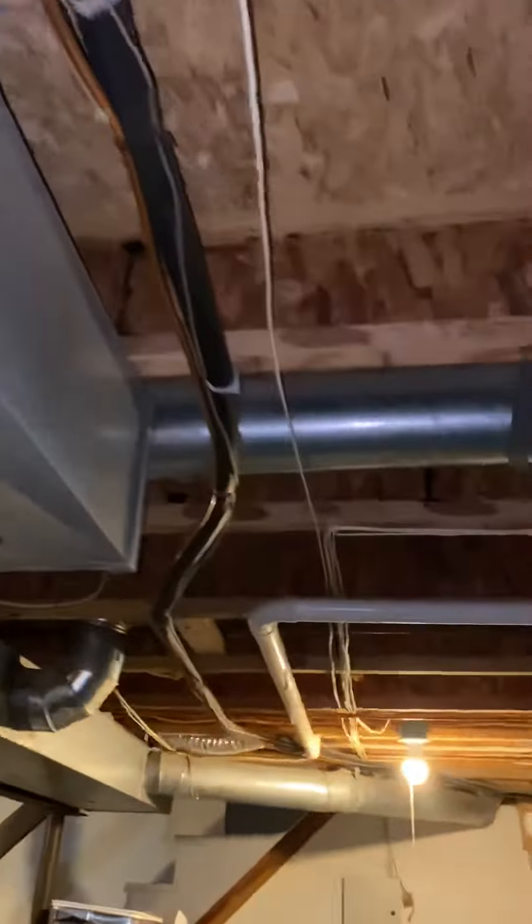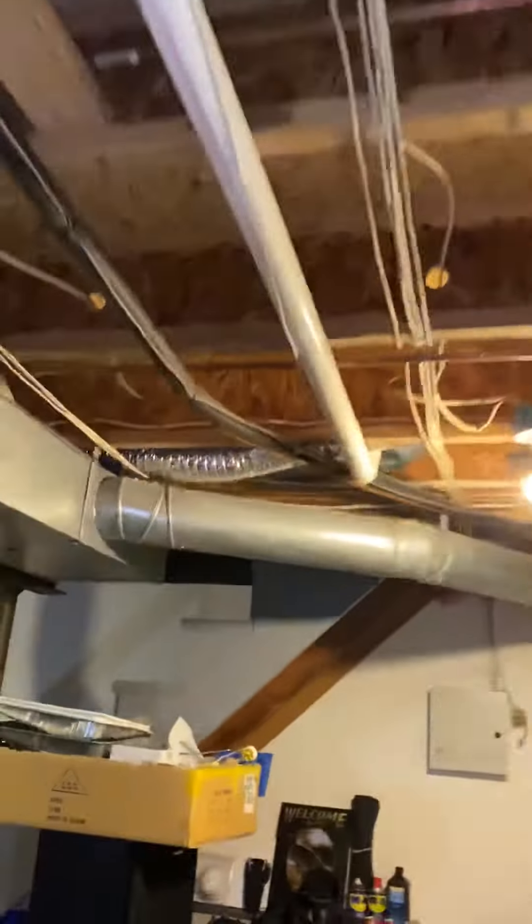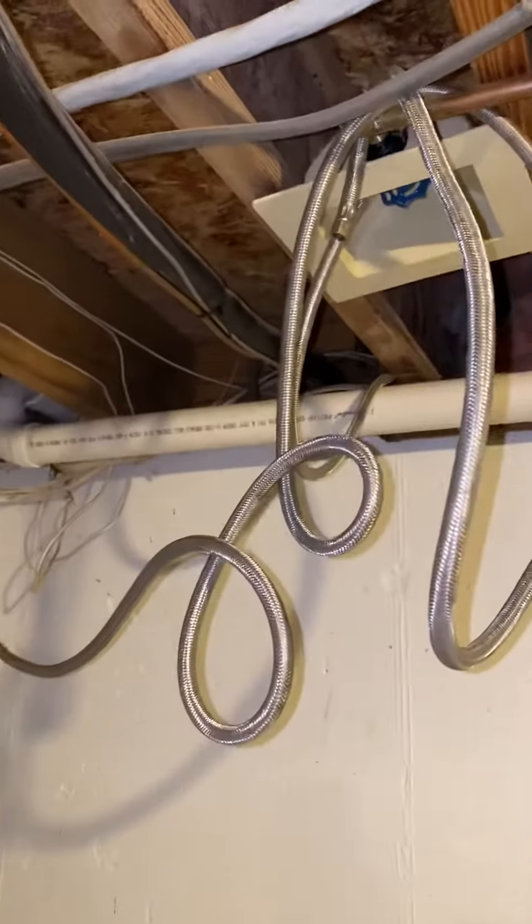Line set is R22, which is sized properly. We can flush all this out. If it needs to be rerun, there's easy access to all that, which is coming out right here. We've got a double 30 breaker, so that's pretty straightforward. Drains are right in front of the unit as well.